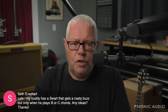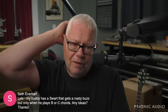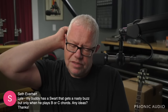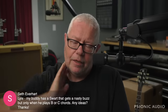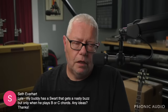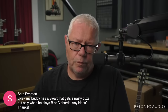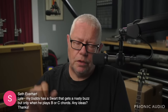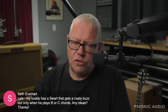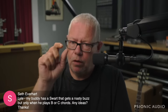Seth, your buddy has a Swart that gets nasty buzz, but only when he plays B or C chords. Any ideas? Thanks. That can be a lot of stuff. You know, that '69 Deluxe Reverb the other day had a buzz if I played an A, and almost any octave below the B string. And it turned out that the wood on the baffle and the cleat had expanded and contracted at different rates. And so a screw that used to be tight was slightly loose, just slightly. And the dress washer behind that screw would vibrate a little bit, but only on A notes.